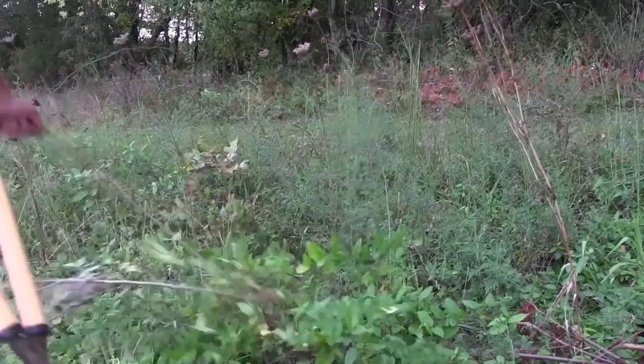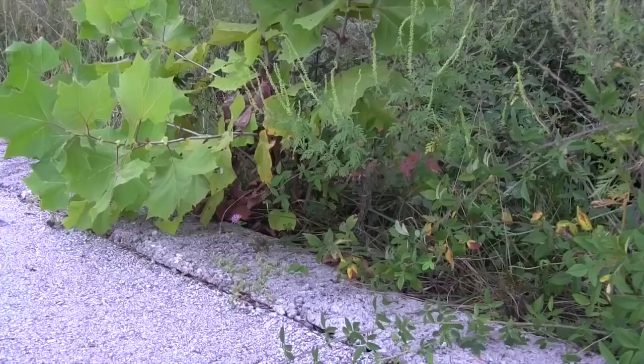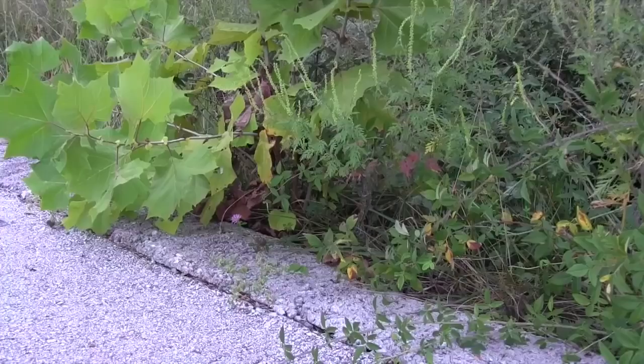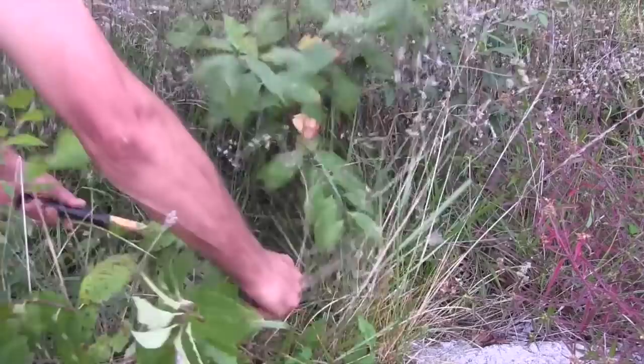The third thing I don't like about a sickle mower: it's not a brush hog. It's designed for grass and it's not going to destroy or mulch the grass — it's just going to lay it over on its side. So if you have smaller trees, I have an area here that I want to mow and I'm going to go through and cut the smaller trees out beforehand so I don't damage the sickle mower. It'll cut a tree the size of your pinky, but it's more wear on it if it does. So it's just not a brush hog.